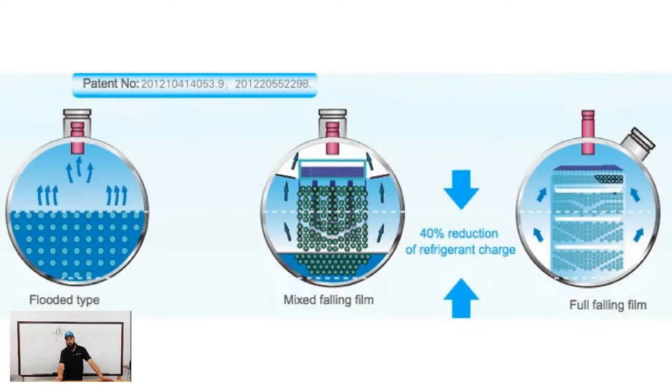So it's really critical that this is monitored to some degree and that you're paying attention. Specifically, I usually just watch my discharge superheat. If my discharge superheat is maintaining, which varies a little bit per machine, then I'm comfortable with how things are going, and I don't hear anything as well. Because when these get out of balance, centrifugals are very finely balanced, and when they begin to get out of balance, you'll hear it, you'll know it. It's pretty dramatic.